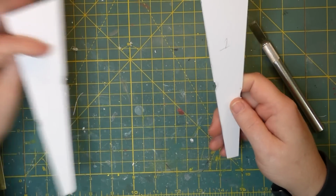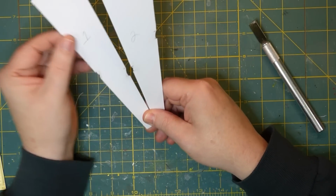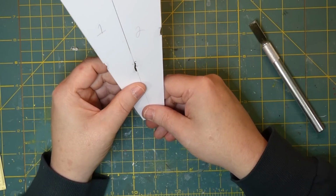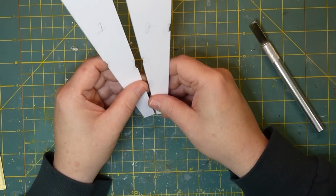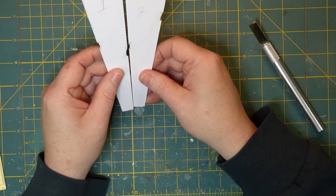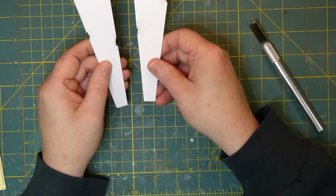Alright, so there's our two pieces. We're all notched for the solder joints. We have nice flat edges up on the tops, on the sides. Now the time is we could bring the sandpaper downstairs and we'll sand the edges until this fits exactly, drops into the spaces between the tracks where they're supposed to go. We need these to drop absolutely flat in there.